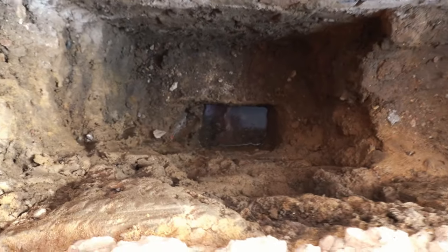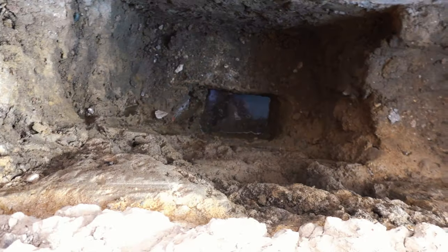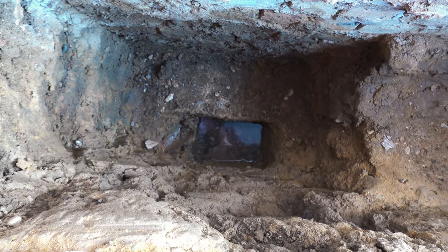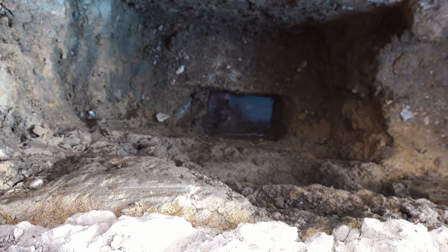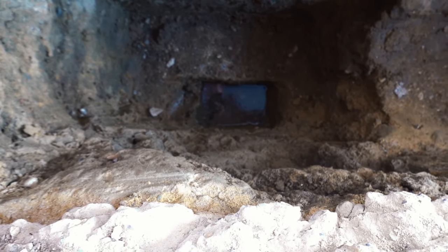That little pipe that I noticed yesterday is an old soak away pipe that is still active, and if you follow it, it goes to next door's bungalow. Next door's bungalow was here before this house, so obviously rather than relocating it, they've cheated and just left it in the ground. But the worrying thing was, it was right up against the foundation slab.